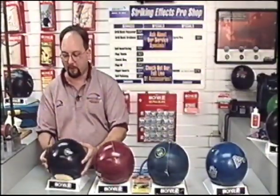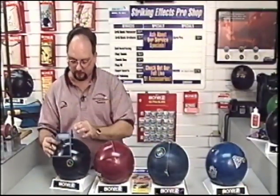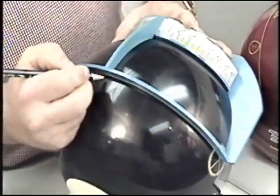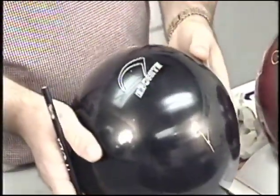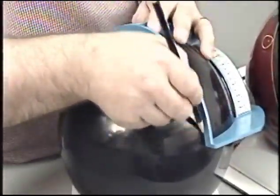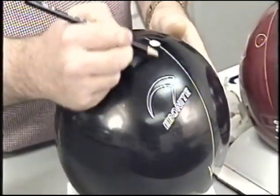Okay, on the 8 Ball, the preferred spin axis ends up there. Using the quarter scale, using that as a direction, 90 degrees to both points, which is 6 3/4 inches on the ball's surface, we get our mass bias in that direction right there. Drawing a line from our mass bias to our pin, we can see that at roughly a 45 degree angle, our CG is off of that line.